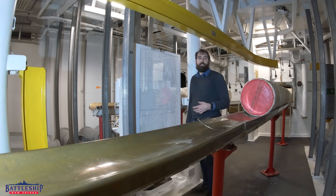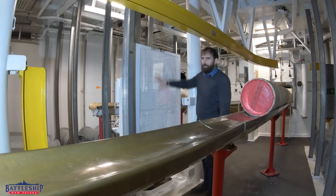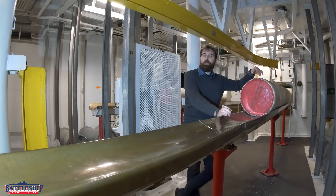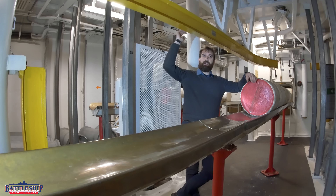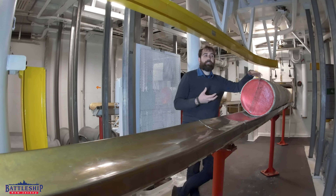Here is the lower end of the gravity hoist. Sailors take the powder off before the hoist goes back up — the back part is the counterweight. There are two rails in here: one rail has sailors putting powder on it from the gravity hoist, and one rail has sailors grabbing powder from the other side of the room. Theoretically an Iowa-class battleship can fire one round every 30 seconds for periods of time, though probably not long periods since you're manually pulling these 110-pound bags. Having a group of sailors on another level passing stuff down helps get more manpower opening powder cans and unloading quickly.